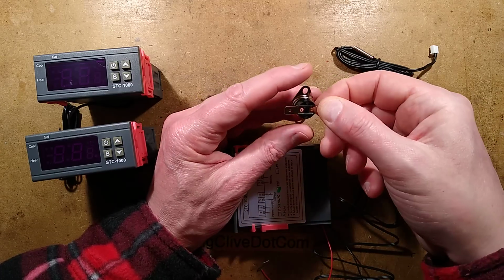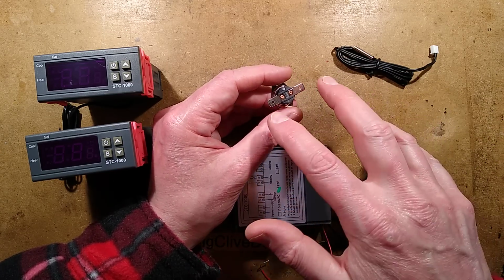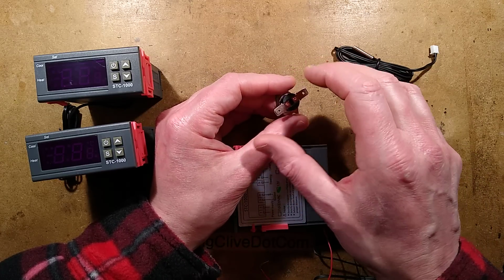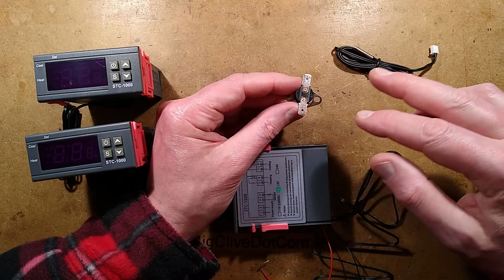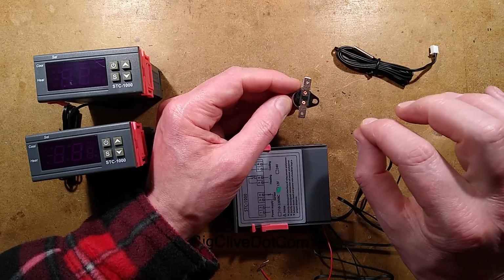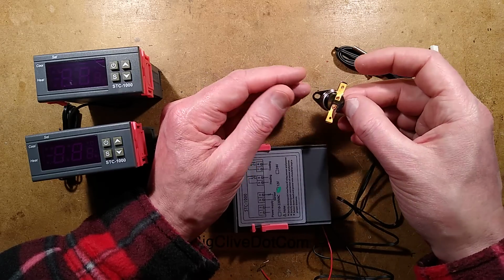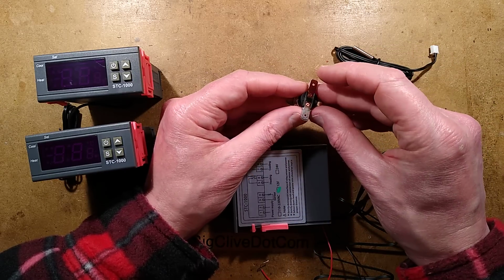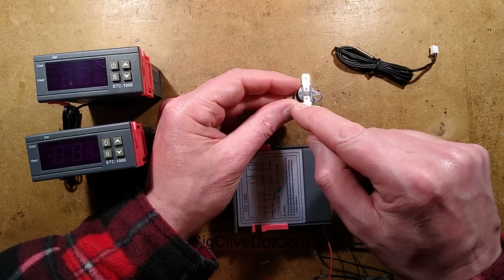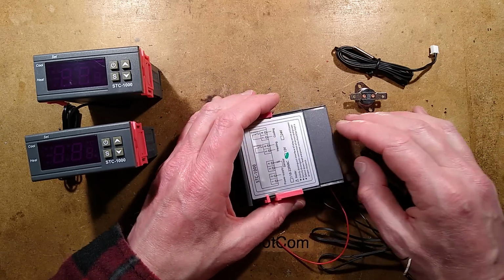This is a standard bimetallic switch, readily available online. Below the rated temperature, it's closed, but when it gets above the rated temperature, it opens. If you want an extra safety feature, put a neon indicator with a built-in resistor across this and put it in the panel with a little warning light next to it. If it ever lights, it means this is actually cut in. It's unlikely in many instances unless you're using high loads, but it can happen. But what happens when this opens and goes open circuit, some of the current flows through the neon and makes it light, and you could put a message on saying, call the engineer now.